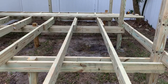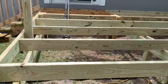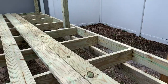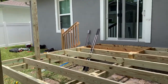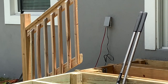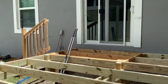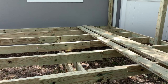We put two sets of beams and one beam on each side of the ends. Posts are all set except for the one right here, which I'm going to be putting on that old 6x6 and toenailing it into the 6x6. And boards are being brought out to finish up the top portion of the deck.